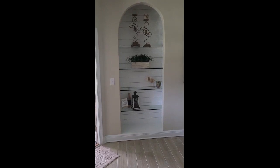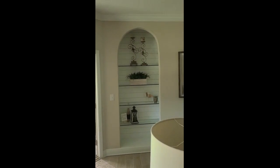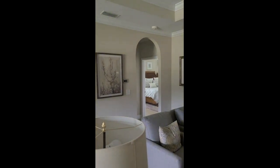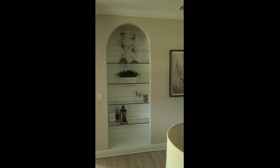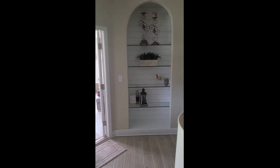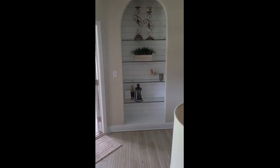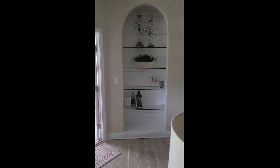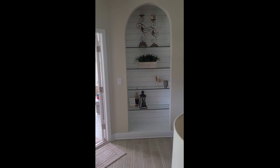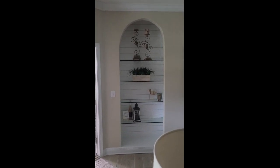The only imperfection is that the top of the arch is not perfect. What happened is I made the arch using the existing one as a template and had the header area made up ready to go, but when I got inside the box there were some extra double studs where my light switch is now, so I couldn't go quite as wide as I wanted. Therefore the geometry of the arch was changed by about a half inch, which really affected things. I haven't given up — I'll go back into the upper right side of the arch and work it with a little more sheetrock mud to get it closer to a perfect arc.